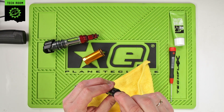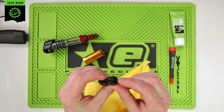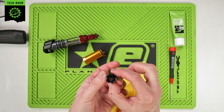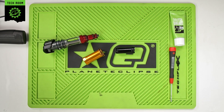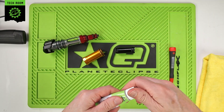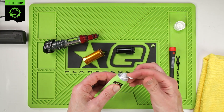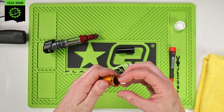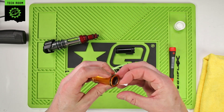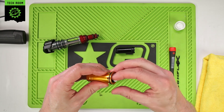You can check the fingers inside on the flexible bolt tip — that all looks good. Now we can start to rebuild the bolt and can. Take a small amount of grease on the fingertip and work that around the inside of the number 17 O-ring.